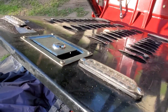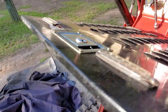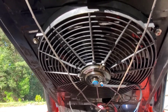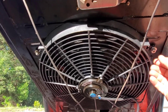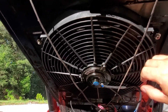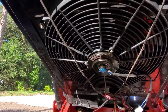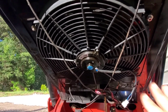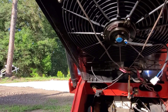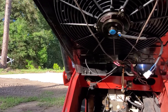Alright, so this is where I'm at. I held the fan up underneath here and I marked my four holes where I'm going to be drilling. This is what it looks like — I haven't tightened it down yet, but I held the fan up, marked where I wanted my mounting holes to be, got it all drilled. I'm going to tighten it down now and then I'm going to be running some wire to the battery and up to the switch.